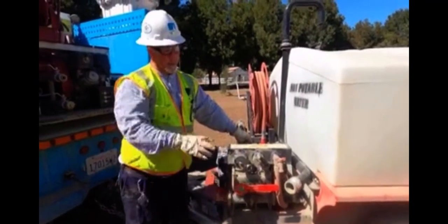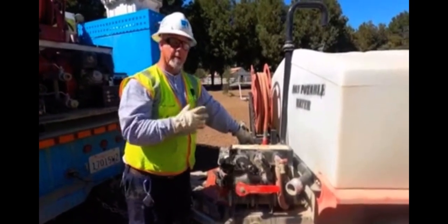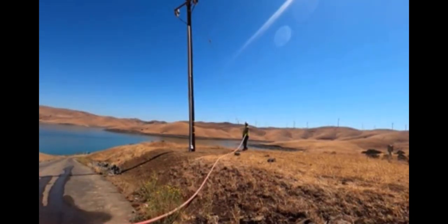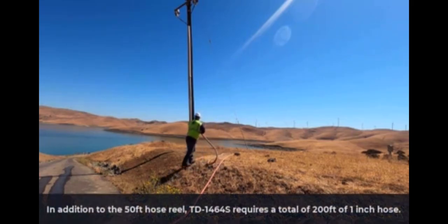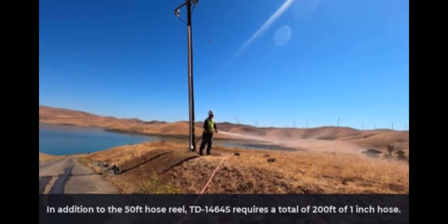Hopefully we're only using this for preventing fire. There are a couple things we can do when we pull up to the job site before the rest of the trucks arrive: we can pre-treat the area, spray around the pole in a 10-foot diameter, or maybe a 50-foot diameter if we're on a slope and fire is going to run uphill. We can pre-treat uphill, spray 75 feet of wet grass and get those annual grasses real damp before we bring the trucks in. We're limited with our reach because this is only 50 feet, so we may need to disconnect it from the towing vehicle and allow the other trucks to come into the job site for better access.